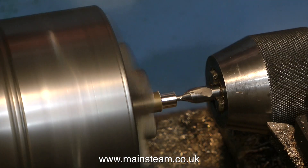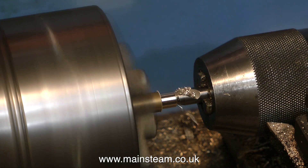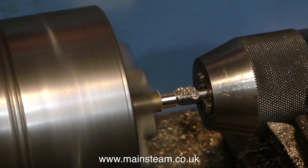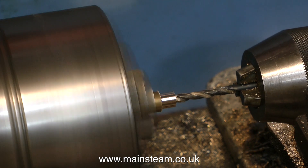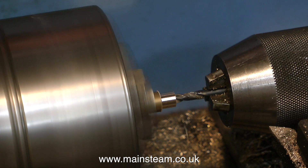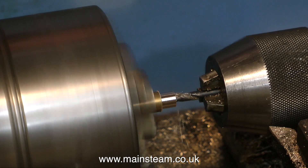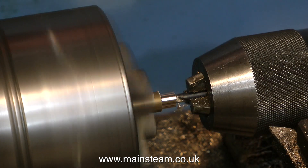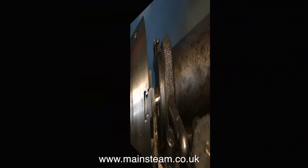The rest of the machining operation is very simple. I'm using a centre drill to make a deep centre hole, which will hold the cone of the union. Then I'm going to thread the outer part 5/16ths of an inch by 32 threads per inch — but not forgetting to first drill a hole all the way through. I've made fittings before and forgotten to drill the hole, so I always make sure to drill it through the component first. Since I'm making the video live — not one prepared earlier — I will forget things; sometimes I even forget to press record on the camera.